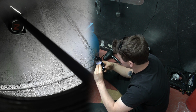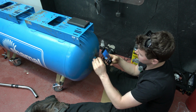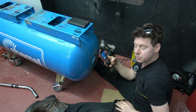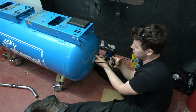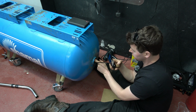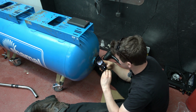So these pitted areas are approximately half a mil deep. Considering the vessel skin, this sheet steel or sheet plate, I mentioned 4 mil earlier, but I don't think it is 4 mil. I was hoping it's 4 mil, but it's 3 mil, I believe. Considering it's 3 mil thick, I have nothing to worry about at the moment.